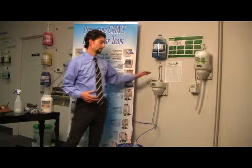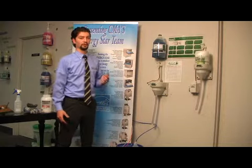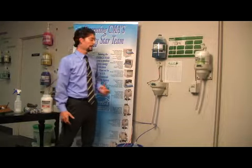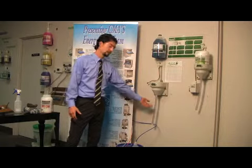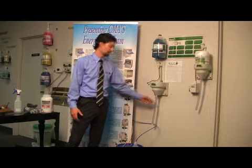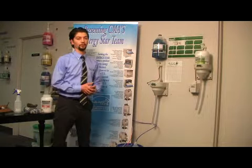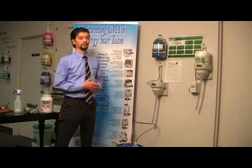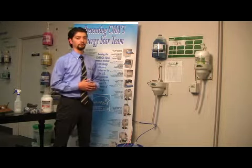If you're using a powder detergent, either the Superior or the Energize, when you drain your machine and refill it and put the fresh water in the machine, it's going to call for detergent, spray water on it to activate it, and come through your feed line. So you'll know that it's getting into your machine if you see the water coming through your feed line. If you're using the liquid detergent, you're going to want to look at your dispenser on the wall and make sure that the detergent wheel is spinning whenever the machine refills.